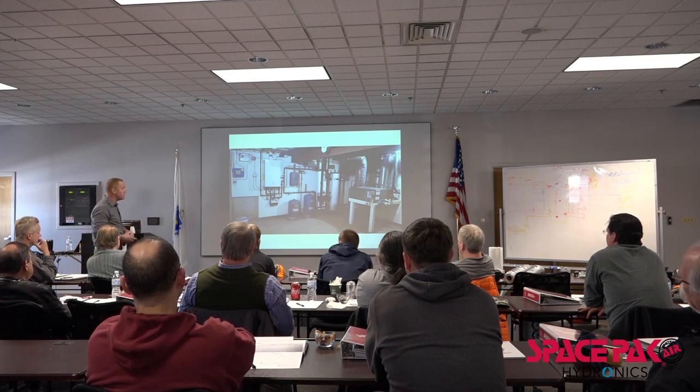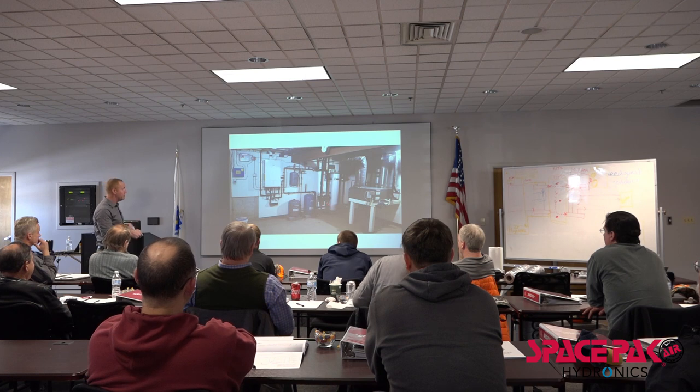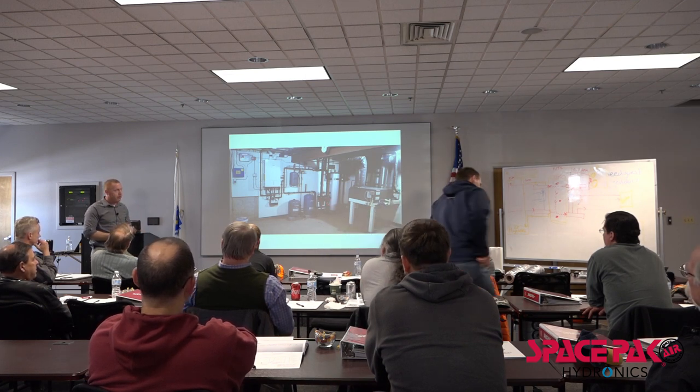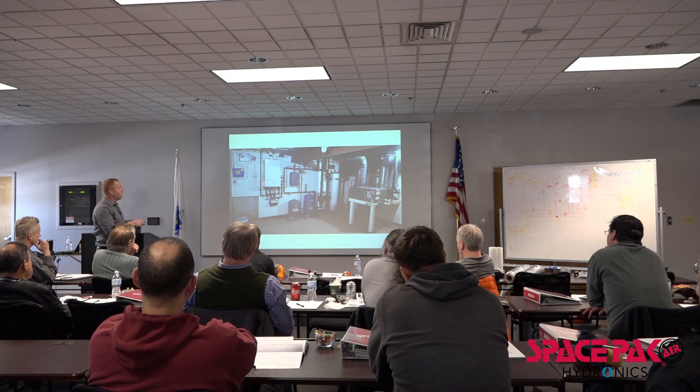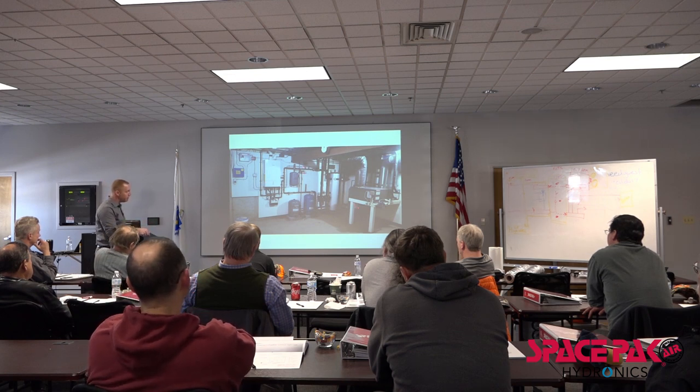This was the last project that I did as a contractor. This is that long house again. But just to give you a layout of how it works, we've got our buffer tank over there, and these two circulators go to the chillers that are outside. There's a check valve in that circulator. There's a check valve right there. This boiler also has a circulator that comes off and goes to an indirect water heater.